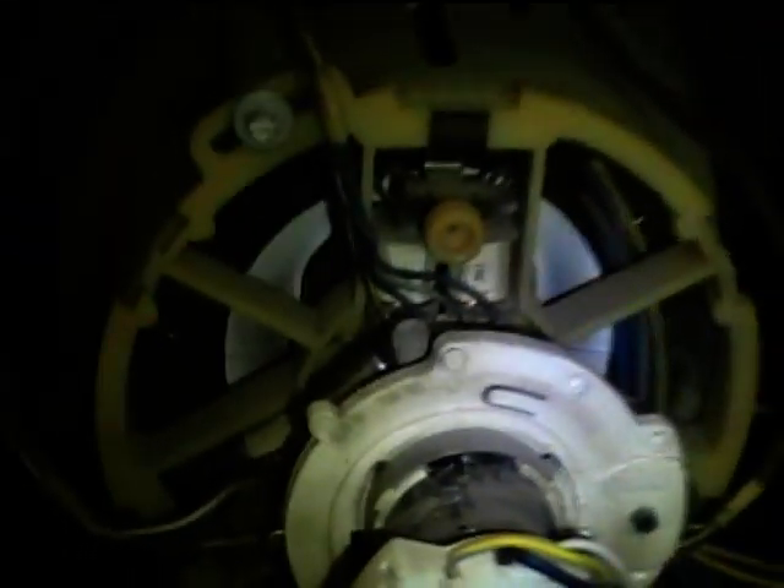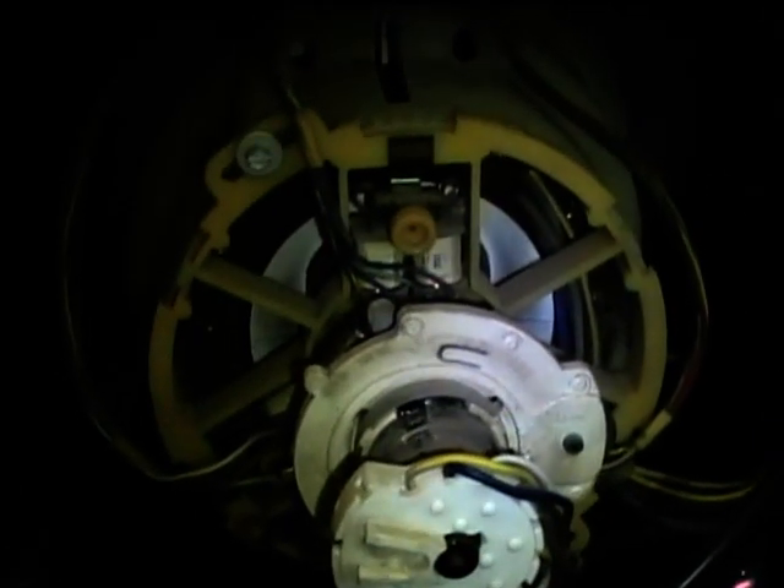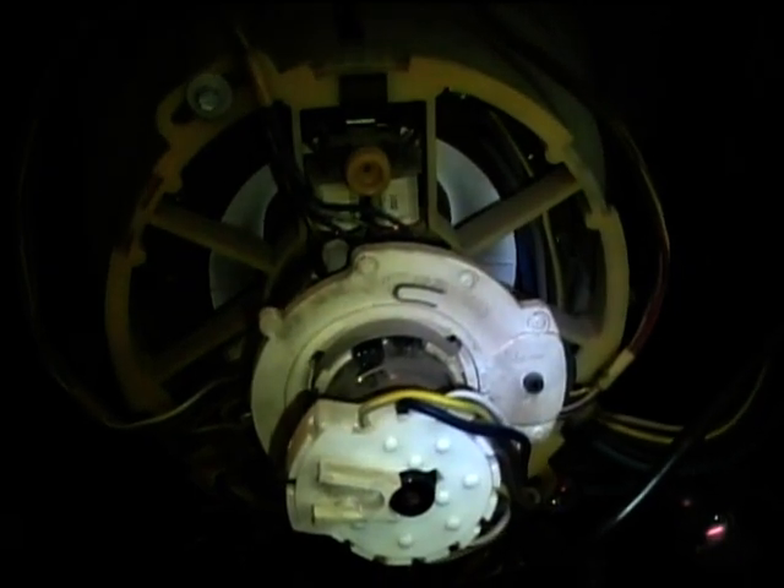You can see it's kind of multicolored right now. I'm going to adjust the rings — you'll notice the red area kind of moves around the screen. What you want to do is adjust those rings so that the center of the screen is red. That's pretty good there. Then to finish it up, you hold onto these clamps and push the deflection yoke forward until the screen becomes completely red. I'll put the camera back on the tripod to demonstrate how that works.